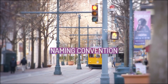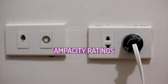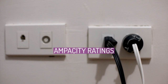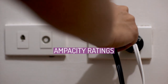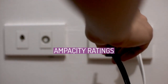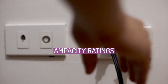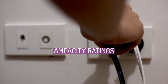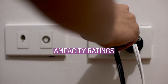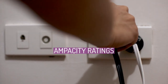The various stranding versions result in different electrical and mechanical characteristics. Manufacturers of ACSR typically provide ampacity tables for a defined set of assumptions. Individual utilities normally apply different ratings due to using varying assumptions, which may result in higher or lower amperage ratings than those the manufacturers provide. Significant variables include wind speed and direction relative to the conductor, sun intensity, emissivity, ambient temperature, and maximum conductor temperature.